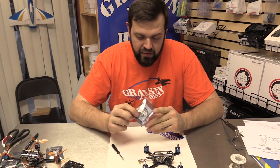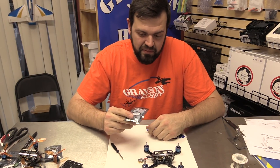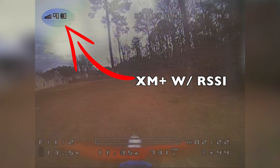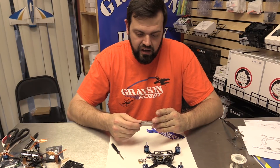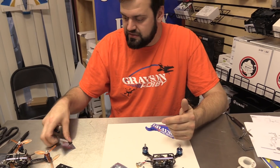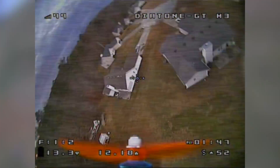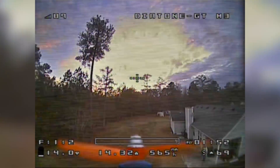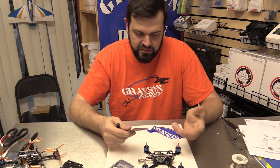We're going to install the XM Plus. On this receiver, you're going to want to update the firmware before you install it, because I haven't come across one yet that has the firmware pre-flashed for RSSI. You have two options: RSSI on channel 8 or RSSI on channel 16. I usually use the 16 one — 8 is supposedly faster with less channels, but 16 gives more options. The other option is the R-XSR receiver, which has the ability to use smart port. But it's just more wiring, more stuff to break, more setup, so I'd probably just go with an XM Plus on this one.